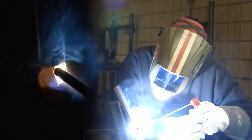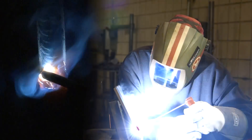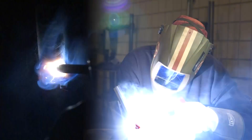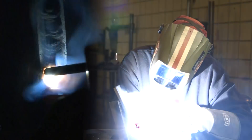The machine seems to arc up pretty strong every time. I'm not having a hard time getting the arc started. I'm trying to weave just inside the beveled edge and pause long enough for it to fill out.